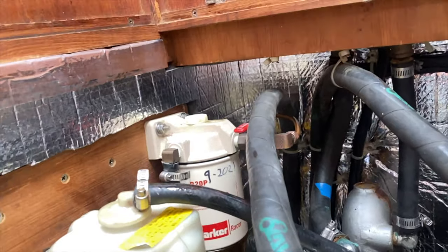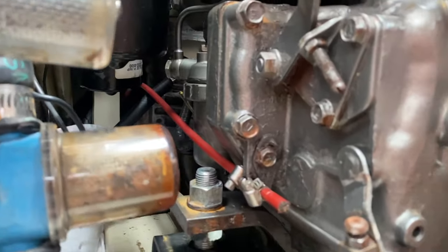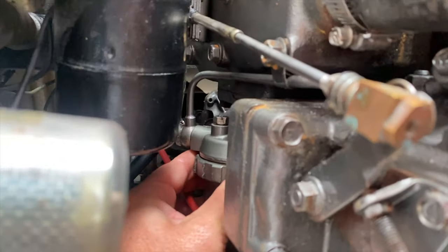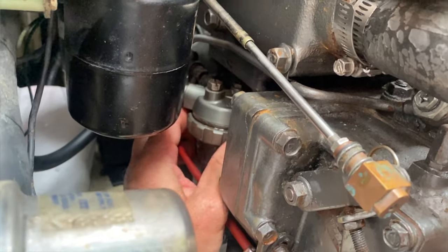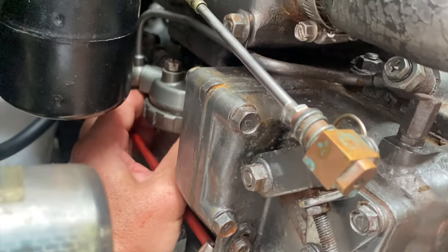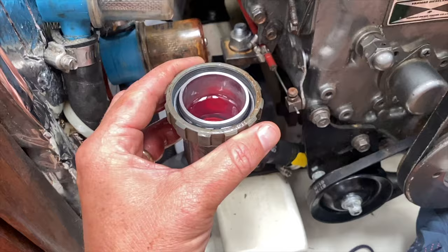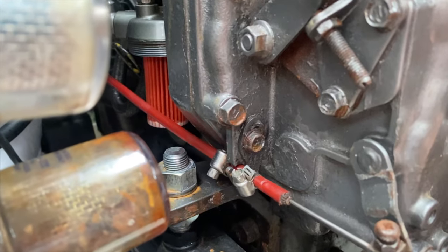That's the primary fuel filter reattached. There's still some air in the top here and we're going to deal with that a little bit later. The next step is to remove the secondary filter, which is a Yanmar-specific item located on the port side of the engine in this small canister. We'll probably need to use a pair of pliers to unscrew the nut that holds it onto the engine. We just needed a little bit of encouragement from the channel lock pliers to get it moving. This little pot I'm holding is full of fuel, so keep that in mind — you don't want to drop it into your engine bay.